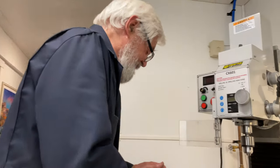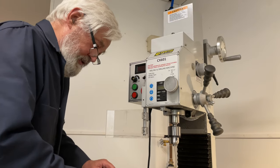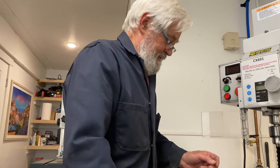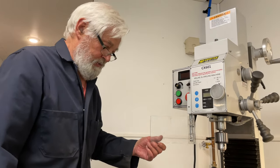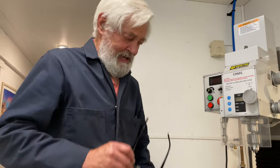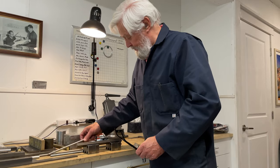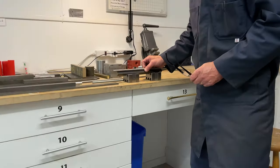So if you have to mill something at a 45-degree angle, like a V-groove, it's much better if you hold the part at the angle rather than move the head at an angle. That's one thing you need to know about, and you'll probably have to do that once a year to set it up, depending on how much you use your machine and how widely. So for the next episode, I hope to have this set up to show how we machine this V-groove into this piece of cold rolled steel, to support a round rod for the guide for the scissor mechanism.